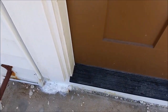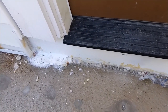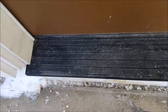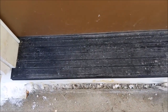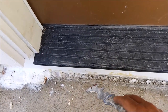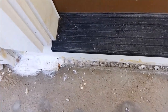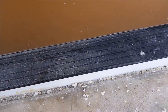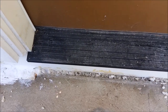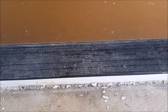But before I want to show you, I want to seal this place between this board and the cement, if you can look at it. I already sealed it with foam, which I will show you. But I really want to seal it so that even if water comes in, it will never go inside — because water with dirt creates a greenhouse for bugs and other creatures that live in here, and that also attracts termites.